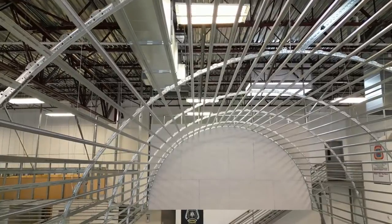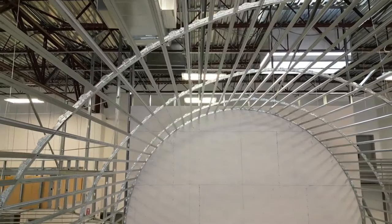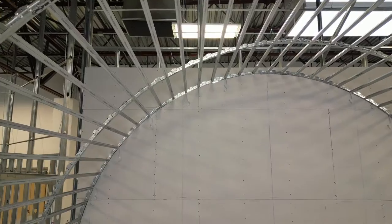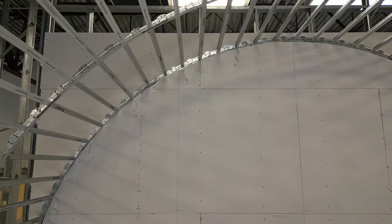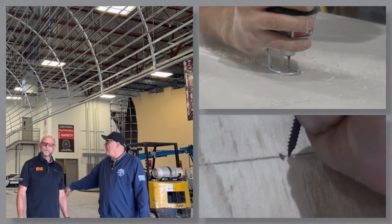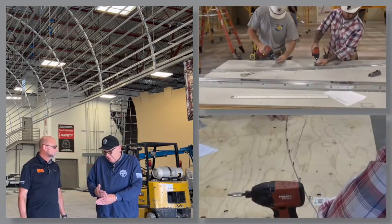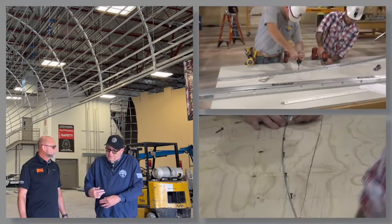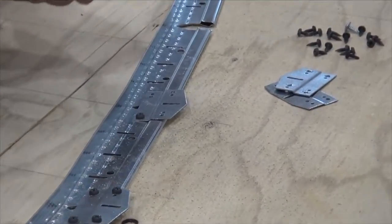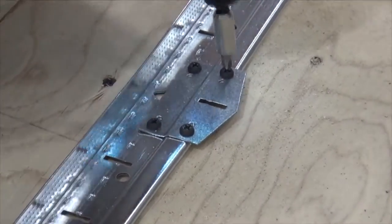What they did is they curved our drywall grid mains, then connected them six feet on center with six-foot cross T's. I set a few of them up marking out and laying out the template, routed out the groove in the drywall so the profile of the main could sit in there, cut the tabs on the faceted mains, and locked them into place with the RC clips. They came out pretty rigid.